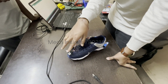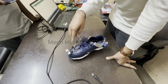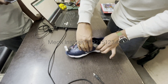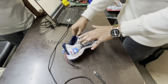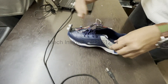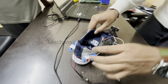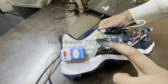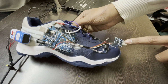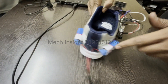The microcontroller reads the distance, and once an object is detected, the buzzer turns on along with an LED light as a front indicator. We also use a vibration motor to indicate to the blind person that there is some object ahead. The components used are: Arduino, buzzer, LED, ultrasonic sensor, vibration motor, and a 9-volt battery to power the system.